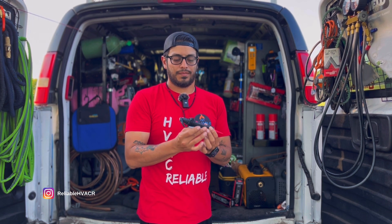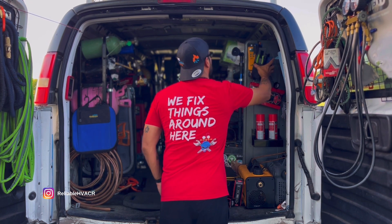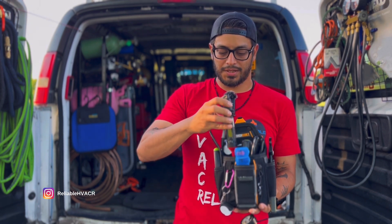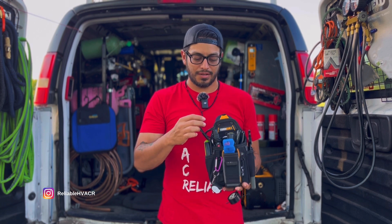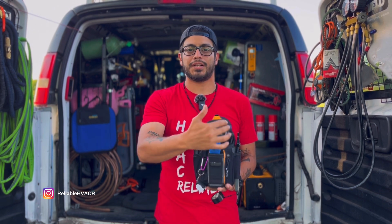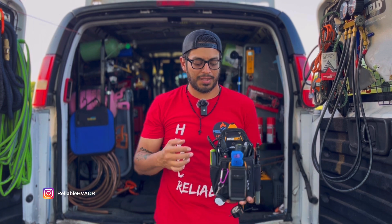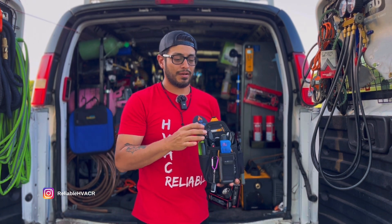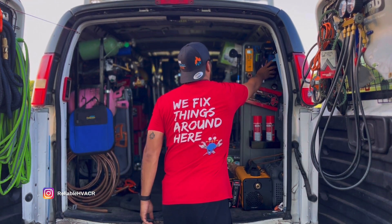So that's how I roll it up and I can toss it into a bag. That's crazy because I have a bunch of multi tools in here, and this completes the tool bag because it has a meter when I just need to check voltage, just need to check maybe microfarads. I'm not doing a full system check with this — I'm going in to check a contactor, maybe do some wiring repair and maybe change out a thermostat or a control. So let's say I already got the troubleshooting out of the way because this is not a troubleshooting bag whatsoever. I can go back in there with this hooked onto my belt and get in and out real quick without carrying a big tool bag.